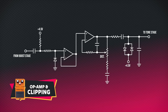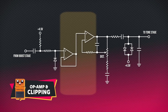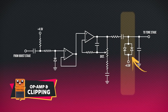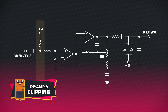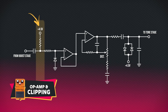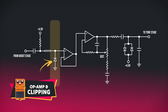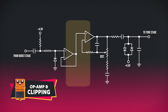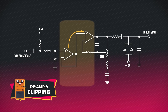Moving on, we are met with an op-amp gain stage which isn't all that different from the gain stages in any op-amp based distortion effect. Here we have twin op-amps performing amplification, with the gain of the amplifier being set by the distortion control in the feedback network. This is then followed by a pair of diodes connected to AC ground which will clip both halves of the waveform into hard distortion. We see this positive 4.5 volt AC ground being set up right after our DC blocking capacitor, biasing the input of the op-amp to the middle of the voltage range. This diode connected to ground is there to protect the op-amp from any rising signal voltage that may cause damage or produce undesirable behaviour. Then we have two op-amp stages, one feeding directly into the other, set up as non-inverting amplifiers, increasing the signal level.